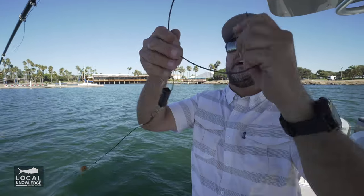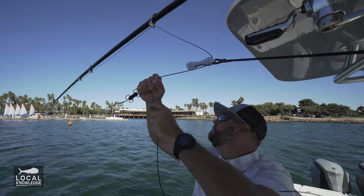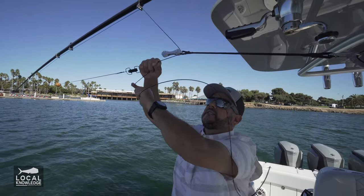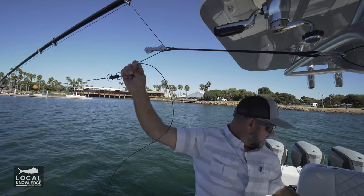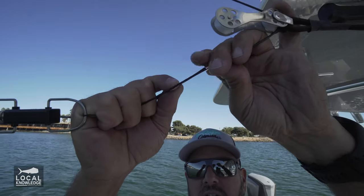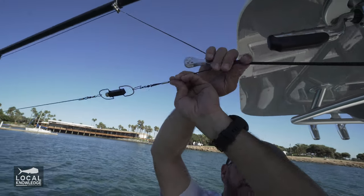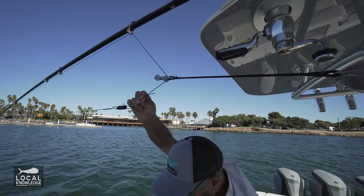Now I need to size this line. What I mean by sizing it is I want to put tension on the line, but not too much tension. You can see the length of the snubber — I just want to make it a couple, three inches longer, and that'll give me a nice amount of tension that still has some give. That feels and looks about right. I'm going to cut my line down just a little bit, feed it into the crimp, being careful not to let the position of the line change. Tension still looks good — nice stretch here with plenty more to go, so it'll absorb some shock while we're bouncing around offshore.